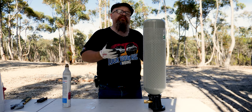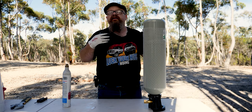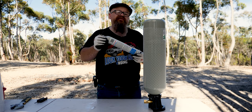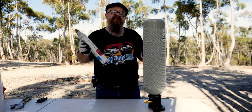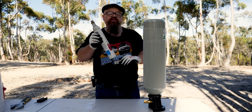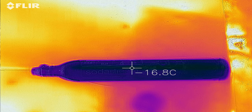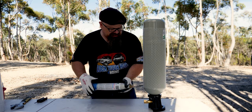I've inverted the bottle so all the liquid is down at the bottom and we'll make sure we get liquid CO2 out of the valve. I've grabbed our CO2 bottle — I'm wearing gloves because I just pulled it out of the freezer. We do it from the freezer because we get more liquid into a colder vessel than one at ambient temperature. It's nearly minus 17 degrees Celsius — let's screw it on.